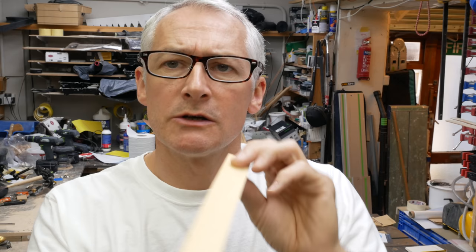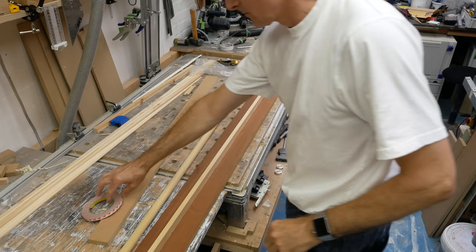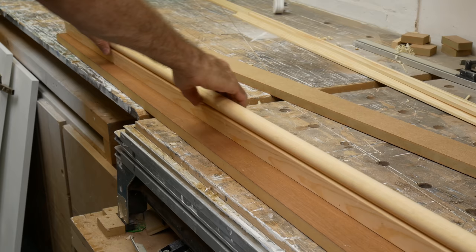So that worked out reasonably well. I've got to be very careful that you don't sort of twist it as it goes through. I've never really thought about it, but I presume that's how they made propellers — which is obviously not what we want, because we're trying to get two perfectly straight halves. I wonder if there's any mileage in just pinning a flat piece to it to act as a stop as it goes through. That might help. I've got a strip of wood that's just a little bit longer than the dowel — I'm going to lay that on a flat board and double-side-tape the dowel to that strip wood, so that should keep it located along its length when I make the cut. Fingers crossed — I can always get some more if I need it.